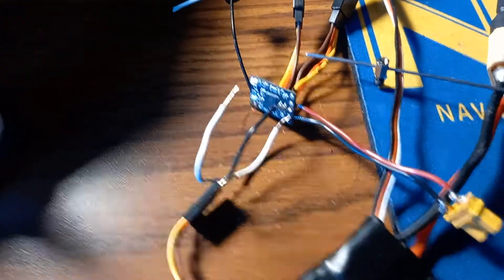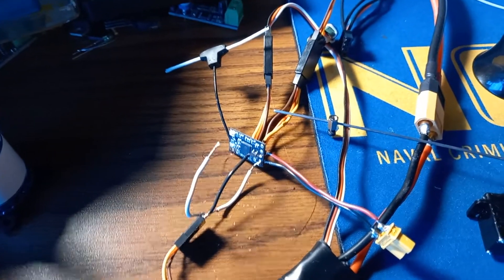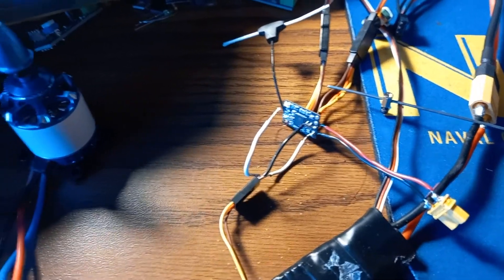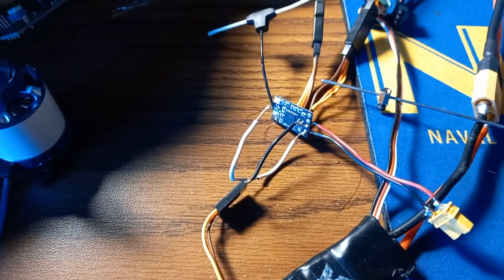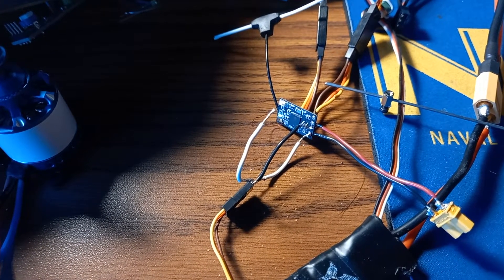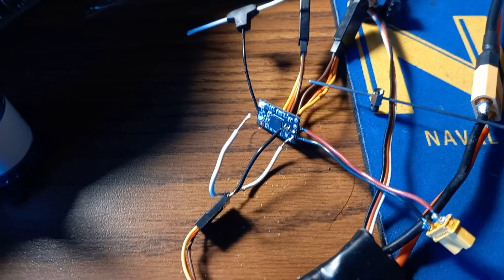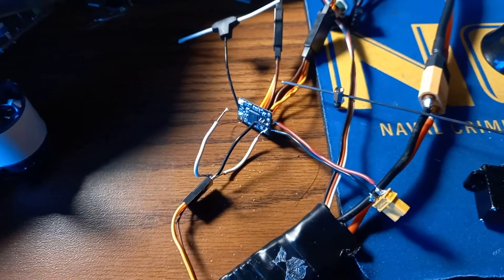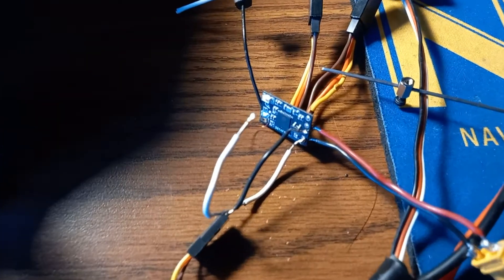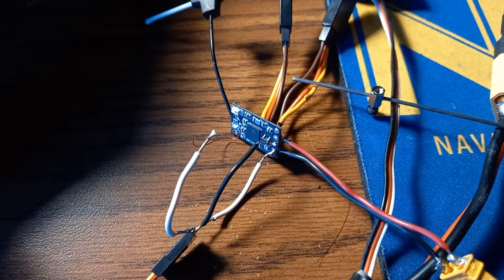So how does this work? It's relatively straightforward. Essentially it's a custom build of the latest ExpressLRS version, and it's outputting PWM on the former Crossfire RX/TX lines. One of those is channel 1, channel 2, channel 3 — and the third channel is connected to the user button, the reset button.